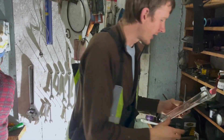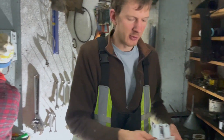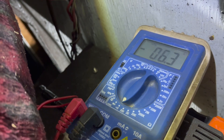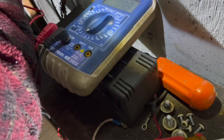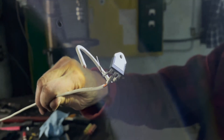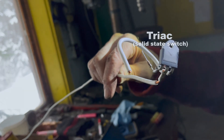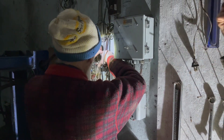We've discovered that two of our heating elements are not working, and Art just showed me how to check for that. Basically, take your multimeter and put it on the end here — you get almost zero resistance, probably enough to beep the continuity beeper. Being really careful because the wires are bigger than the terminals. One of the very early governors Art made back in the early 1990s. He doesn't use that design anymore. It's a little switch that turns those elements on and off, and one of those switches failed along with two of the elements.